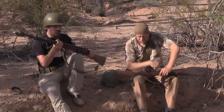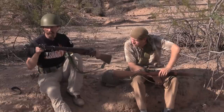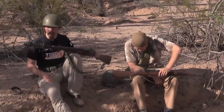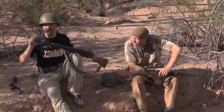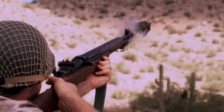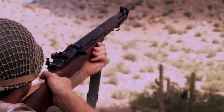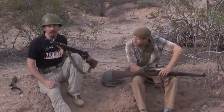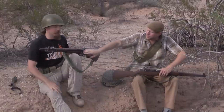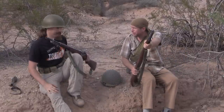One real downside: the little plunger that opens the valve in the gas plug means that even if the grenade is not on there, your gas plug is venting — so you effectively have a single shot rifle. If you load a clip of regular ball ammo, it'll go through just fine, but you're going to have to rack the action every time because your gas system is not working. In World War Two, you'd have one guy in a squad issued one of these, and he'd probably leave it on and be ready to fire grenades — meaning he wasn't in the front line because his rifle was effectively a single shot. Since the sights weren't really in play in World War Two, guys got good at 'gee whiz, this looks about right' — and with enough practice, just like anything else, you'd get good at it. Remember you're only shooting out to a maximum of 200 yards, and you are shooting a grenade that explodes and has a radius — close does count with hand grenades.